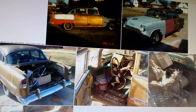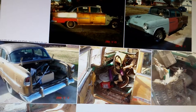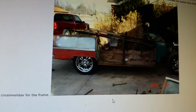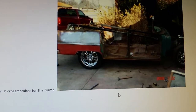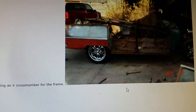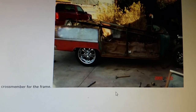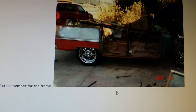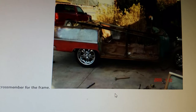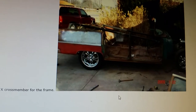I cut the top off the car. I actually welded in a bunch of bracing in the body to brace it up before I cut the roof off so it wouldn't fold up on me. There's the steel bracing rolled in to brace and support it. I actually pissed off a few people doing that — most guys call four-doors 'parts cars.' After I started cutting it wasn't so bad, but man, that initial cut was like, oh crap.